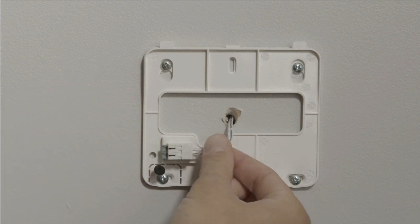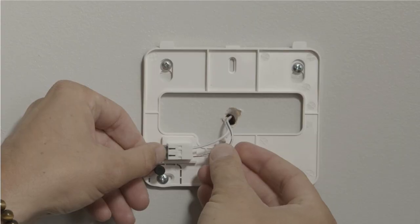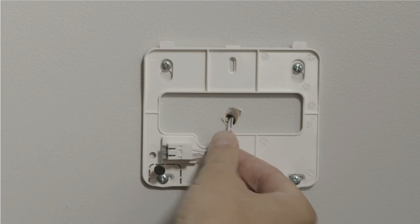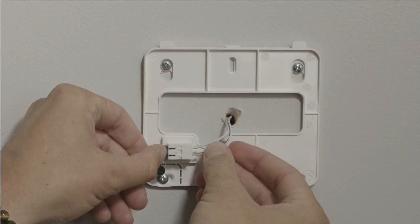The Smart Mount wall bracket comes with every IQ Panel, and its simple design was a direct result of listening to our customers. Inspired by smart thermostats, simply line up the mounting holes to any single, double, or triple gang box, and then push in your wires. As you drop the panel down onto the Smart Mount tabs, the pins engage and provide power to the panel.